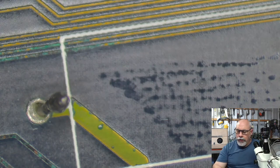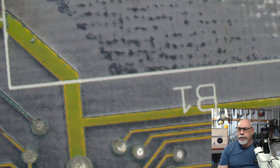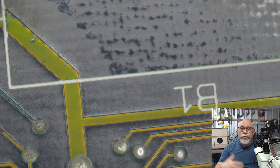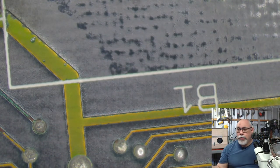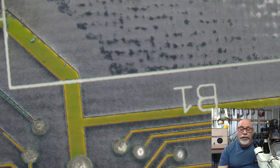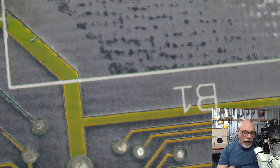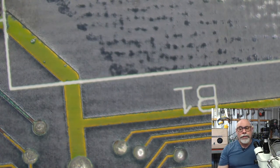Alrighty then. Yes, a long time ago, 30 years ago, some evil person put that capacitor on in a way that would inconvenience me now. The fact that this needed a battery to start up and the battery was hardwired to the board tells you about how long they thought these computers would be working for. Now, they were lithium batteries, so they would have expected at least 10 years of reliable battery charge from that, possibly even more. But at the end of the day, a battery is going to run out eventually. And the fact that they hardwired the battery on there that is needed to make the computer start means they really weren't expecting these things to get used now.